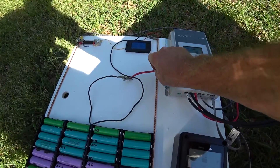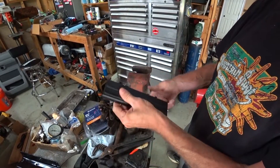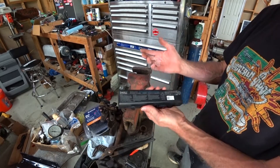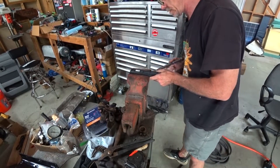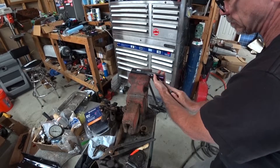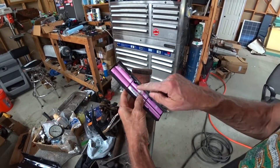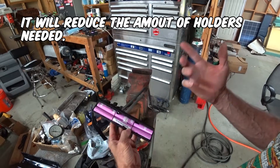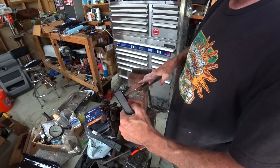I'm getting three amps of solar right now. This is where I get my batteries from — this is a bad battery pack that can no longer be charged in a regular laptop charger, so I just disassemble the pack. One thing I've learned on YouTube is you can take the cells and sit them in the holders with two cells still attached together and it works the same. I may take that route going forward and not have to separate the cells individually.